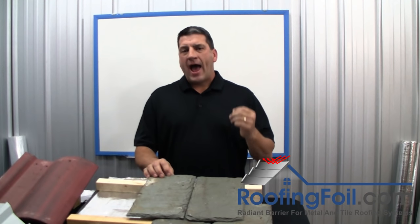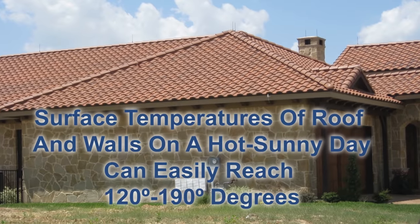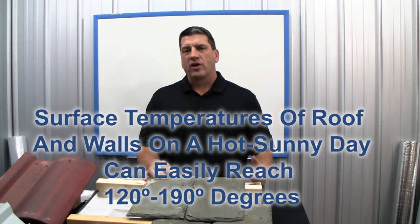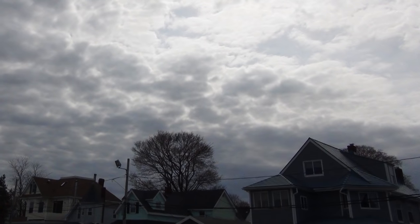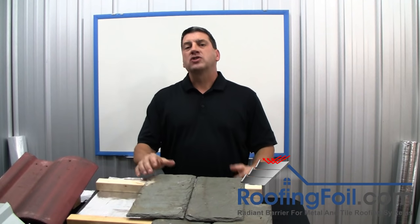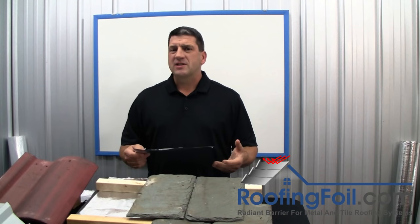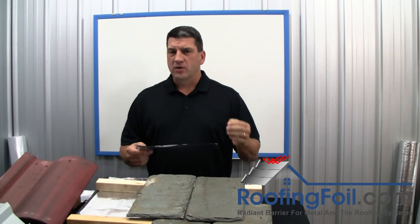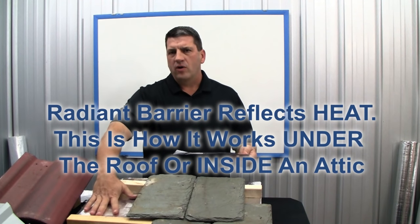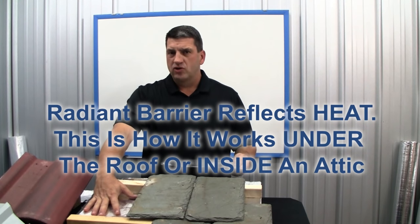A house is just like a car parked in the sun. That's why you may have a day where it's only 60 or 70 degrees — relatively cool outside — but because of the radiant heat gain, you have to run your air conditioner. And you may have some days at 80 or 90 degrees where it's cloudy with virtually no radiant heat and the house is perfectly comfortable. If you were to cover the parked car with roofing foil, the temperatures inside the car would act almost exactly as though it was parked in the shade. But it gets a little tricky in a roofing application because the foil is actually reflecting the heat even though it's not exposed to the direct sun.